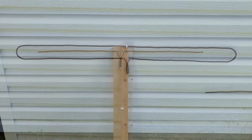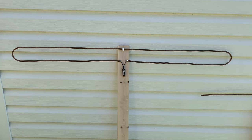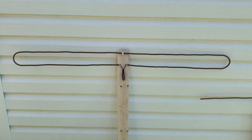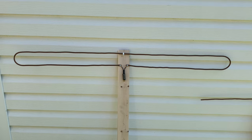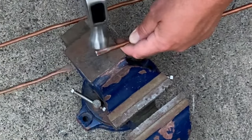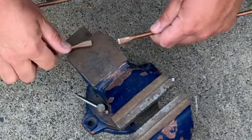That's why I went with a folded dipole. To make this antenna, I took an eight-foot piece of copper tubing, straightened it out, and made a mark two feet in on either end — that's where I made the radius bends using a spray paint can. I then pounded the ends of the pipe flat with a hammer, which gave me a flat surface to screw the transformer to.